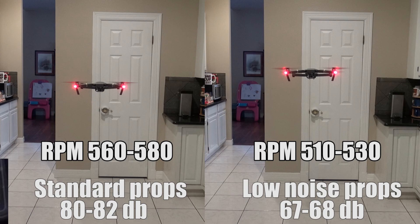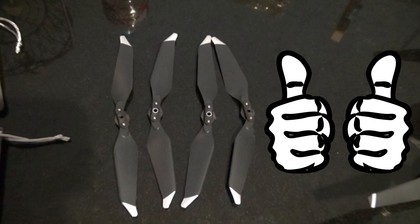More lift means it's easier on the motors, and if it's easier on the motors, that means you should be able to get some more battery life out of this. So if you can get more battery life, you get more flight time, and it's less wearing on the motors because they don't have to spin as fast. And I know a lot of people will say, well, 560-580 versus 510-530 — but when you're talking about flying a craft multiple hundreds of times, I would imagine that would have an impact on the longevity of the motors, since they don't have to work as hard as normal. So as far as I'm concerned, definitely two thumbs up on these Platinum props.